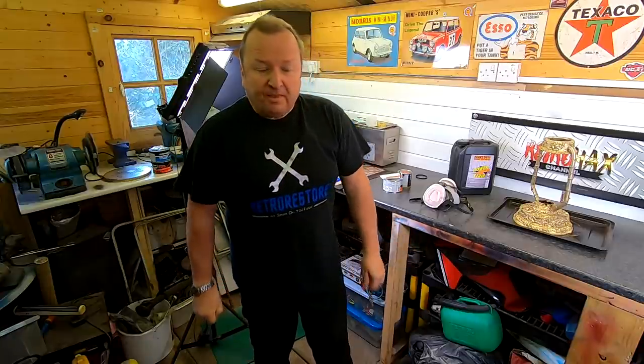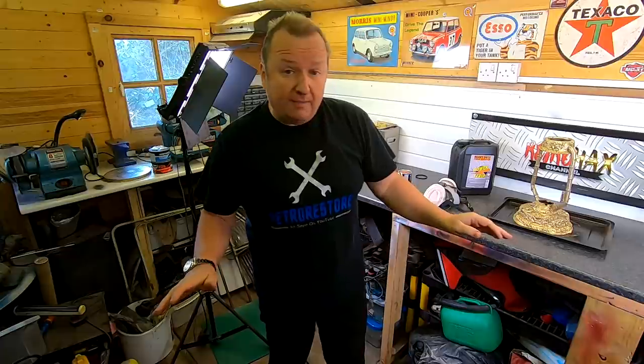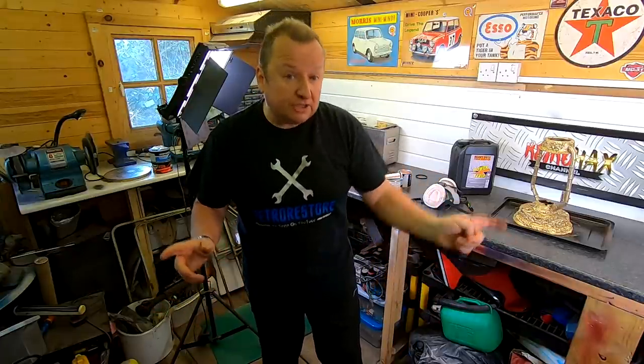So that's that. Yeah, so I'll let that go off. I've just put the gun to one side. There's no need to clean the gun out in between spray coats. I'll give that 10 minutes, come along with a second coat, and this time I'll go on it with a little bit heavier coat.